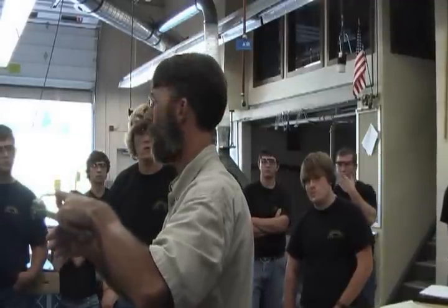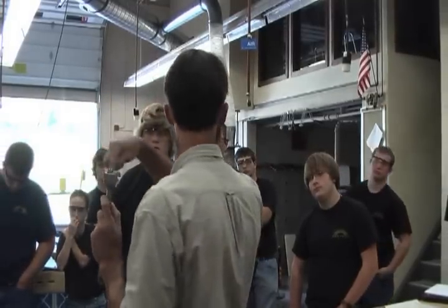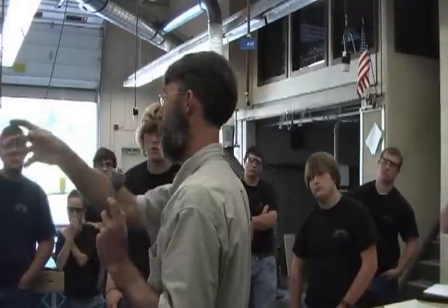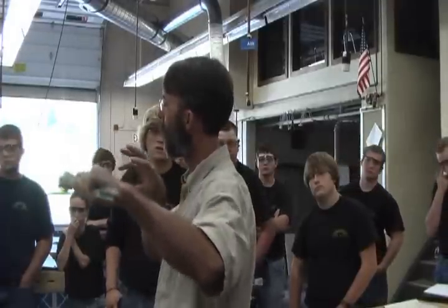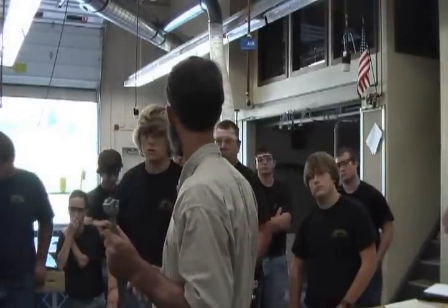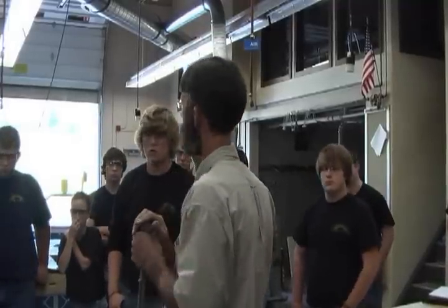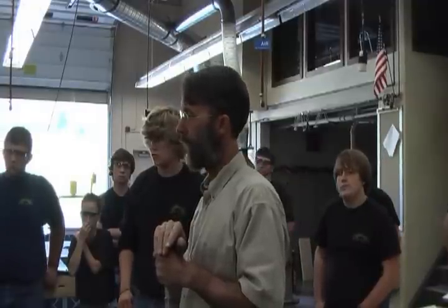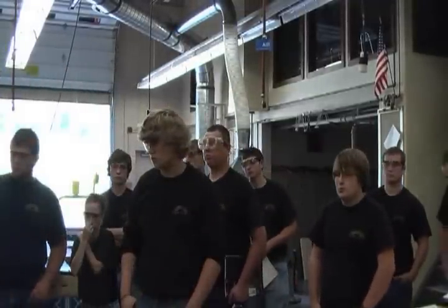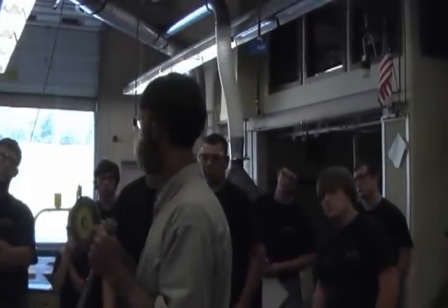I have a machine that's made for sharpening things like end mills and router bits and things like twist drills. And it has all kinds of neat little knobs and dials and clamps, and you can put the tool in there and it will do it. The more complex a shape, probably the more advanced, more complex, more expensive the machine setup. So that can be done. They even make a wheel something like this that is kind of a soft rubber with an abrasive that you can use for deburring things and take the sharp edge off.